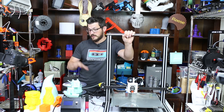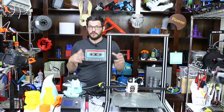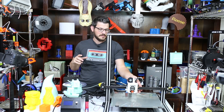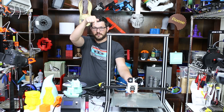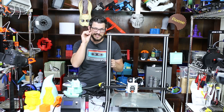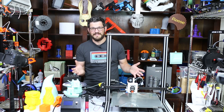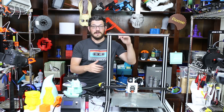I have a bunch of different prints here and several different filaments that I was trying out. I was noticing a little bit of wobble and the one eccentric nut on this carriage was not enough to actually get everything intact, so I put another one on top. It's a little crooked so the nozzle is not quite perfectly perpendicular — it's a little bit canted. I'm not noticing too big of a difference but it's just a little bit off. The carriage on this honestly kind of sucks. This printer is not fantastic but it is a great use for a large nozzle because it is 400 by 400 by 500 millimeters.